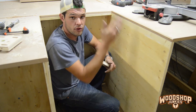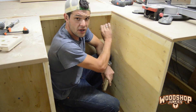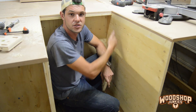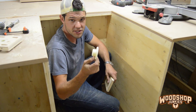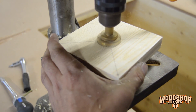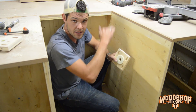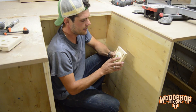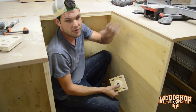With the bed for the miter saw pretty much complete, it's time to install the pivot on the bench. The pipe is obviously going to run through these two panels, and I'm going to put an oversized hole here. I'm using a 90mm (3.25 inch) stainless steel pipe, so I'll put a slightly bigger hole so it can move and allow for adjustment. The pipe on the underside I'm going to house inside a nylon bush that I had made by a family member — I'll post dimensions on my site. The bush goes inside a square block with a hole drilled in the center; it has a flange with four holes and I'll fix it with screws. The square block also has slots, giving me the ability to adjust the height on the miter saw to perfectly line up the bed with the top of my workbench.